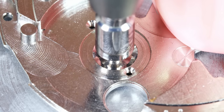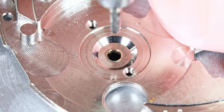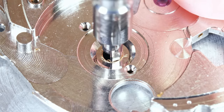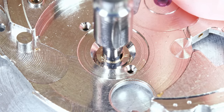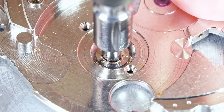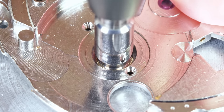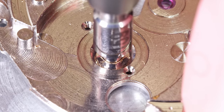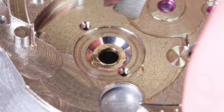The hole in the date dial guard is on top of the main plate — the hole there is for the barrel pivot, and we need to enlarge it for the jewel. This is not some promotional video — I bought the jewels for the full price with my own money. I started with the 1.39mm reamer and I'm showing you the final 1.79mm reamer. The jewel is 1.8mm, but since there was no 1.69mm reamer in the set, I went for the 1.79mm. This is actually more awkward than the bridge and the main plate because it's very thin and it flexes. Just because I show you something here, it doesn't mean it's the only way or the best way — you might find a better way, and that means you're progressing.